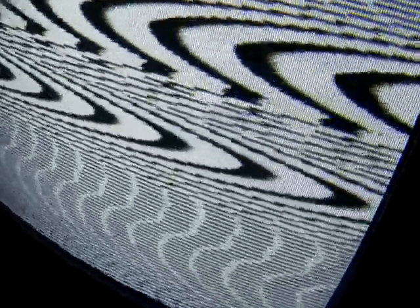We're going to see if we can fix this little Daewoo TV, which has a really common problem in these Daewoo chassis. The problem is you turn it on, tune to a strong channel or any channel, and you get a scrambled picture and distorted audio — just like this. That happens on any channel you normally watch. It doesn't matter if the antenna is plugged in. It might go away once the TV warms up, or it might turn on and work fine, but then start failing once it warms up.